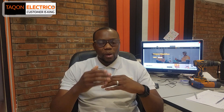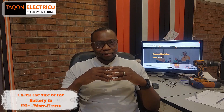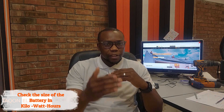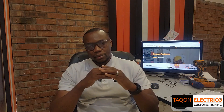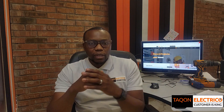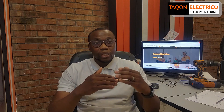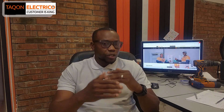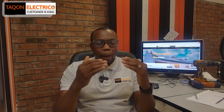Even if you pick a strong battery, if it's the wrong size for your needs you will still run into problems — let's talk about battery bank size. A lot of people think that if you have a 5kVA inverter you just need a 48V battery, or a 3kVA inverter just needs a 24V battery. While that sounds right, it misses the most important part. The voltage doesn't tell you the whole size of the battery; what really matters is the amount of energy the battery can store, measured in kilowatt-hours.